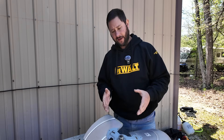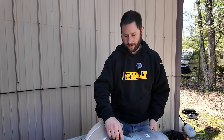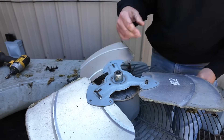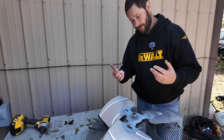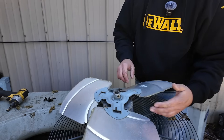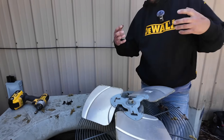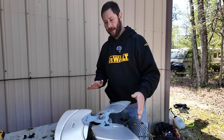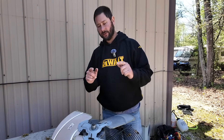What could be wrong with this fan motor? One — the capacitor that powers the fan motor could be bad or faulty. Two — the fan motor could not have power, maybe a bad contactor, but we know it ran so it can't be that. It could be that the bearings are bad. To check the bearings, take the shaft side to side — if you hear a clanking or feel some play, that could indicate bad bearings. Also check for oil around the shaft; leaking oil can indicate a bad fan motor. Since I don't see bad bearings and it easily spins, I think our problem could be the capacitor.